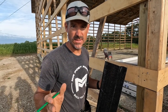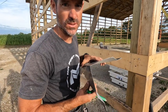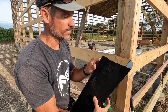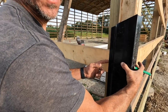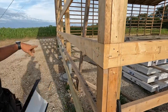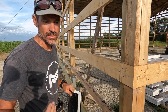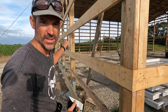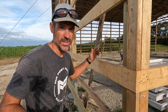I didn't get a steel layout with this — it's a custom build. This is a corner trim, so the first thing you want to figure out is where the ribs are going to lie. I'll put this up here to see how it would fit and mark it on this corner and here on this corner. I know I'm going to start my steel on that end, based on where you're predominantly going to be looking at the steel — the front of the building. I want the overlaps to be away so you can't see them.